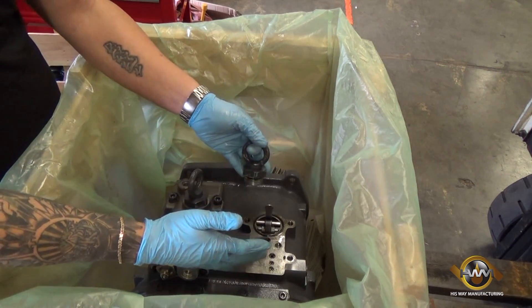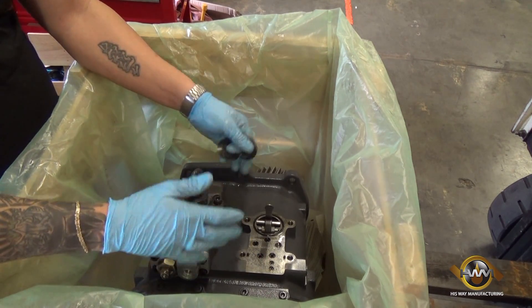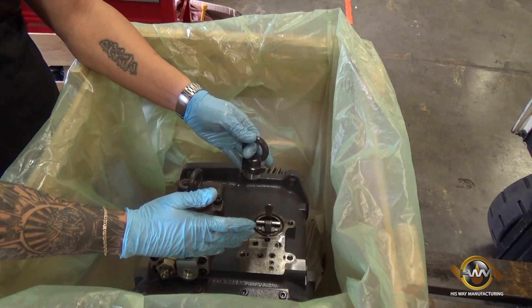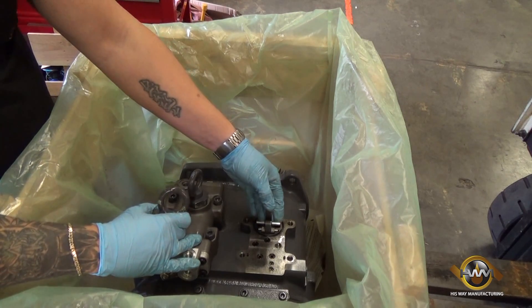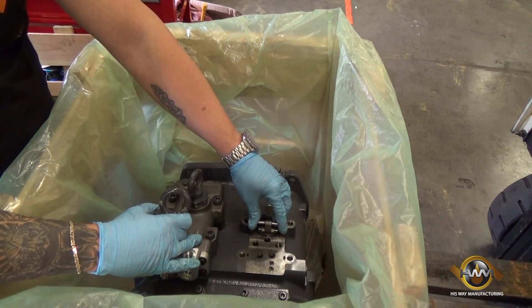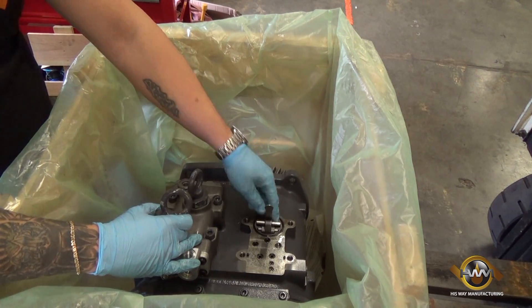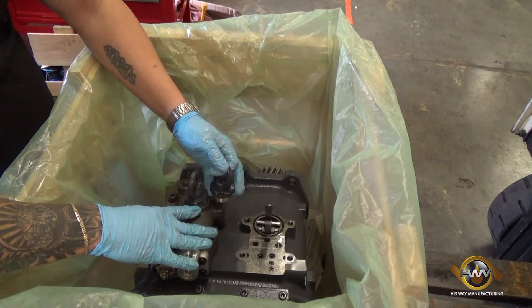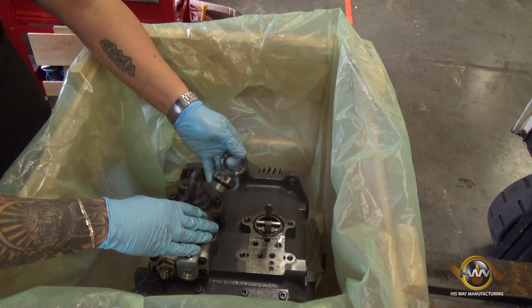After these regulators go on, the pump must go to the test stand to get the regulators dialed in so everything is in sequence with the horsepower curve for the pump. The way this pump was originally set up was a sensor type which comes with a leg connected to the horseshoe that swashes the pump in and out. We must remove this leg so this cap can fit down on the new regulator and nothing is in the way of one another, so operation runs smoothly.